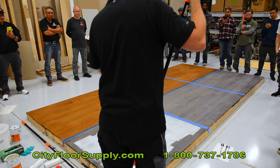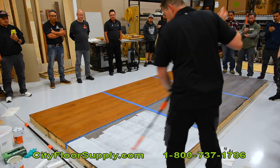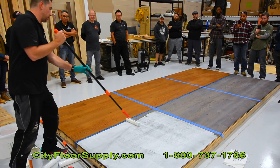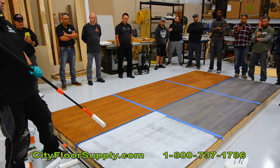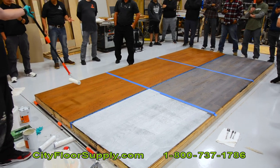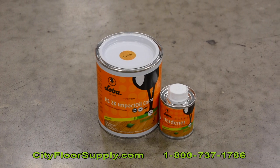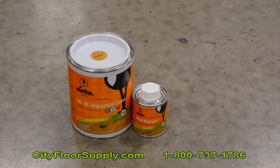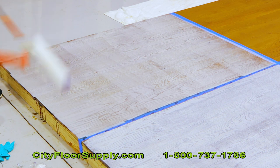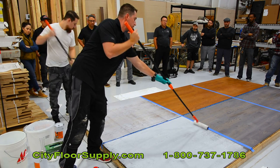Now you're pretty much going to be walking on this stuff, pressing down a little and working into the wet areas into the dry areas. Direction doesn't matter — why? Because we're buffing all of this excess off, so there's no direction, no footprints mattering. You can see we're not really pulling any of that gray color into the white right now — that pigment is still down there. If you get way too much oil on a section, you'll be here for days trying to take it off. A nice method on your first few jobs is to have a second dry roller — either this roller or the Micro 120 with a slightly bigger nap — and if your initial sections are a little too much, come back and dry roll it off. Press down and you're able to take some of that oil back off, then go into another section.